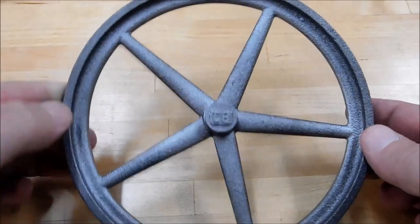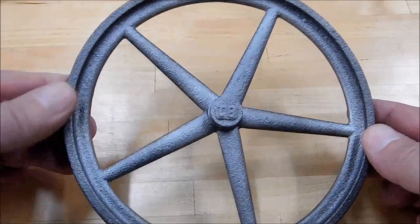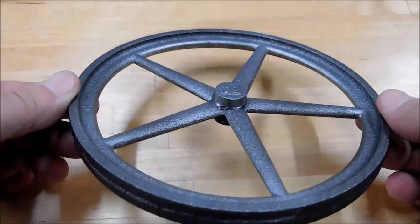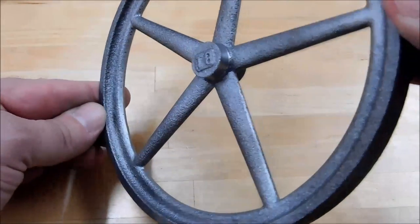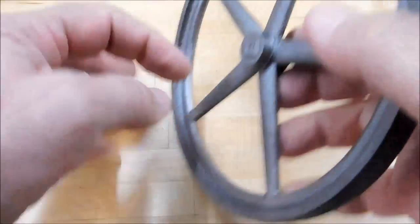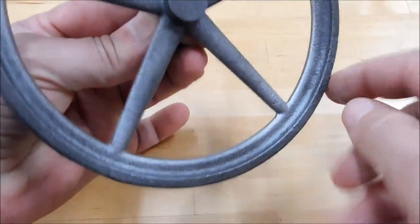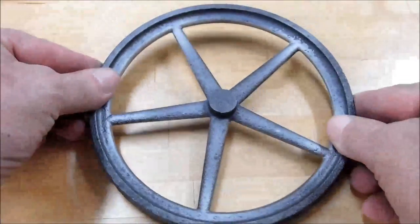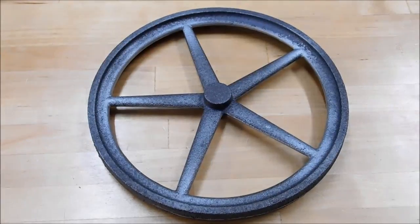I put it in a collet and it's still just ever so detectable out here. And I'll tell you, when this thing is running, I want this to look like it's not even turning. So I'm not going to be happy until I'm there. I'm going to put it back in the chuck on the newly turned diameter here. Dial it in visually so this is running nearly perfect, and I'm going to go from there back to the chuck.